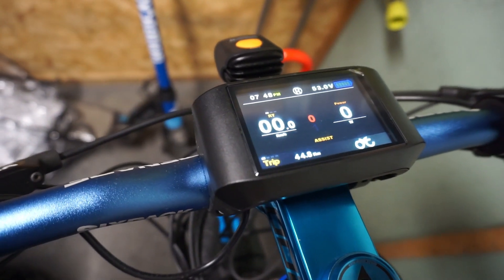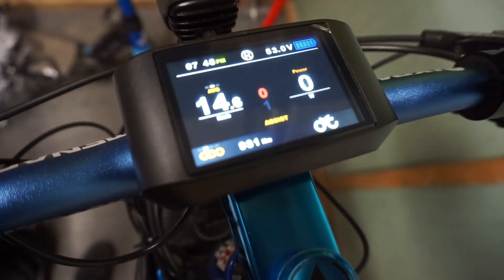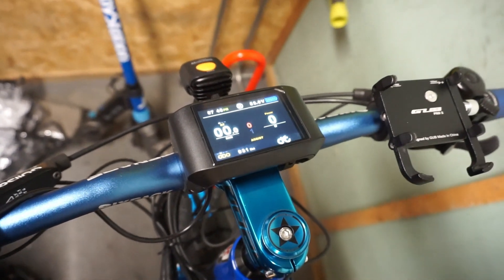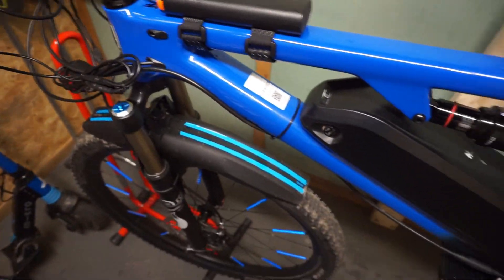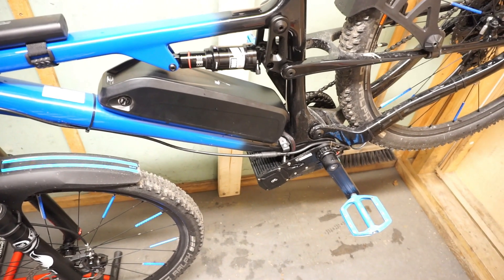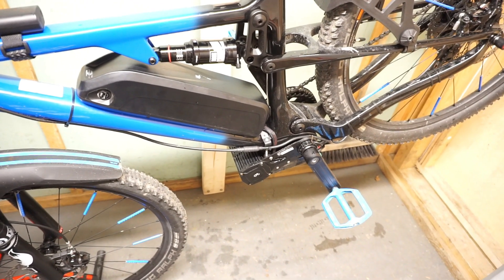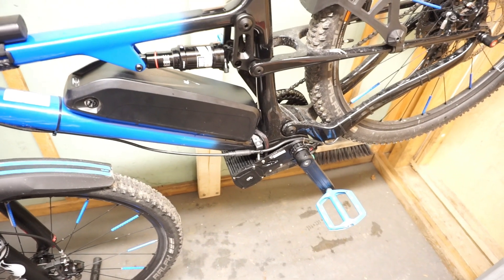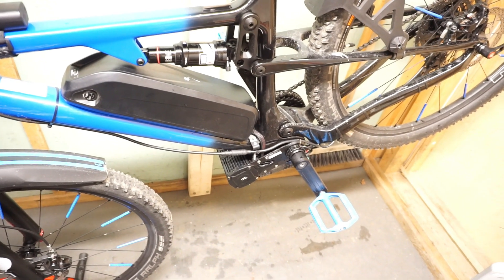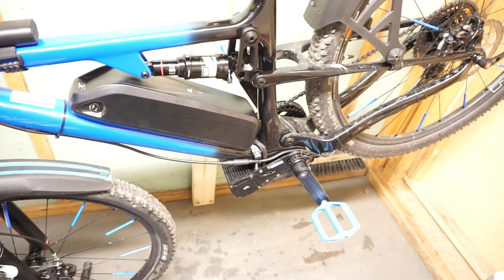If you're interested in the total mileage: I now have 931 kilometers after today's trip. This motor probably requires re-lubrication with new grease every thousand kilometers, but it all depends on how hard you push it. If you ride on assist mode it will last longer with longer service intervals, but if you ride on throttle only then you'll need to do it more frequently.